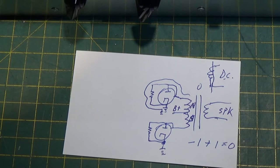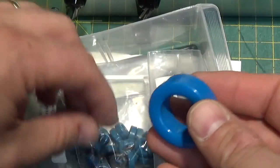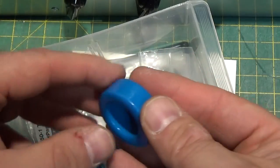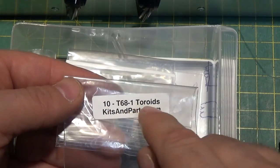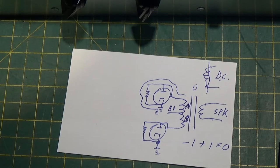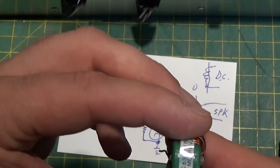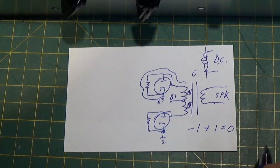When you have a core, it is made of some sort of a ferrous material. When we look at, here's a box full of toroids. And you notice toroids have different colors — these ones are blue — and they're called different numbers, dash one and T68 and all these things. Here's a green one — just showing you some examples. The color coding and so forth represent the type of ferrous or ferrite material that's used.